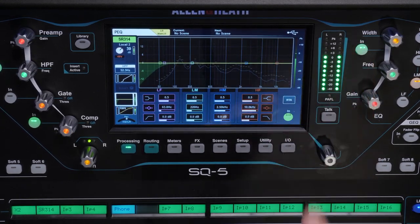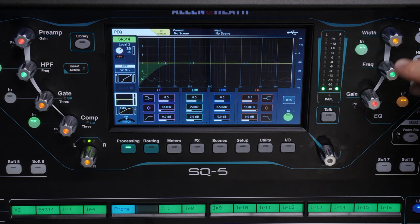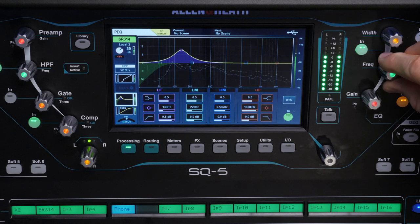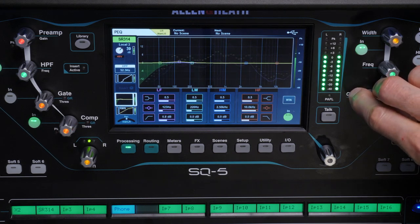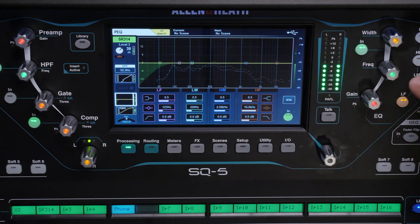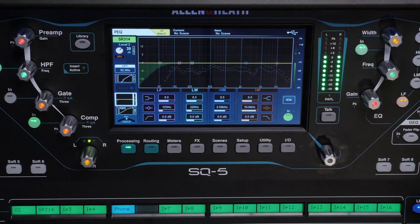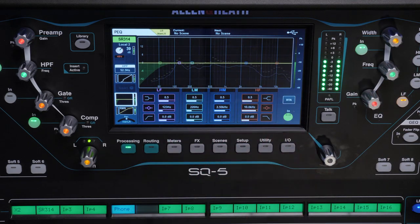Let's bring in the equalizer. And now we have, I believe, yes, four different parameters we can adjust here. So here I'm, for example, adjusting the bass, the low frequency, and you can definitely hear a difference there, right? Crazy woolly is what I would call that. So we don't want to do too much of that. But here's where oftentimes you will solve problems. And by solving problems, when you're doing front of house sound or live reinforcement, typically what you'll do is come in here, and this will help you solve feedback issues.